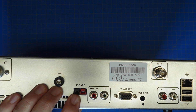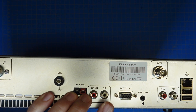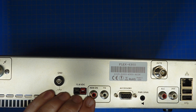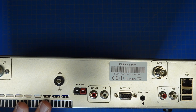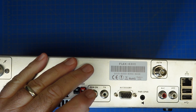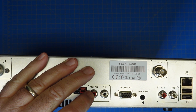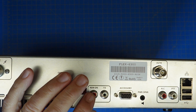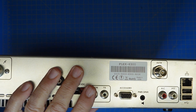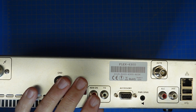Power uses standard PowerPole connections, which is cool, built in. It has a remote on jack and a remote transmit jack. The remote on jack allows you to do a remote power on and off of the radio — a proper startup and shutdown remotely. You just need to short these together and that causes the power state to flip, but it does a controlled shutdown, not just a hard power off like unplugging it. So you could theoretically use this with a smart plug to power the radio on and off.